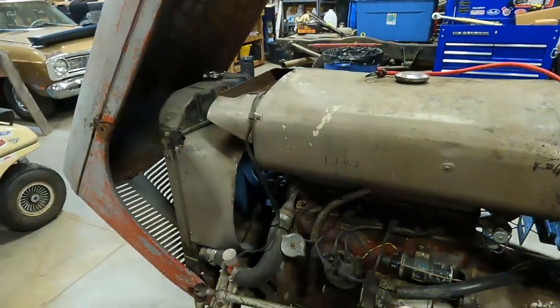So we're not knocking down 12 volts to 6 volts because of the coil and the points. The points don't care if you have 6 or 12. We're knocking down 12 to about 9 because that's what makes those Mopar ignition coils happy.